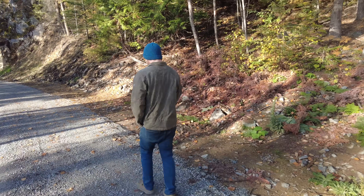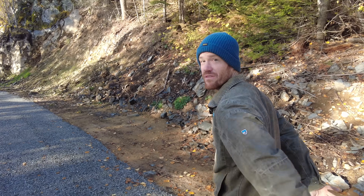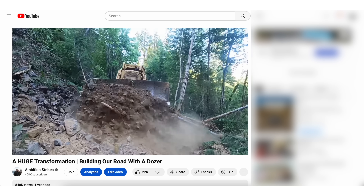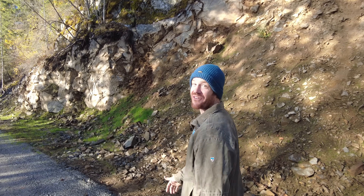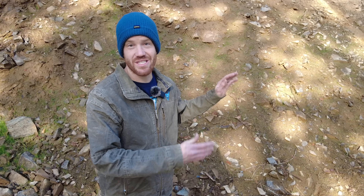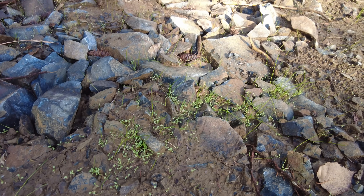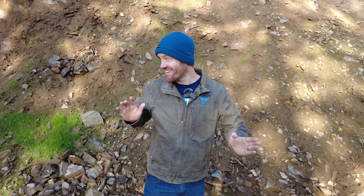But spraying the seeds was only step one, so let's go check out the progress. For those of you new to this channel, Courtney and I spent the last two summers building an entire new road to our property. I cut this all in with the dozer — it's steep here, which meant steep uphill cut banks, and those are the parts we were worried about having erosion on this winter. Wow, that is a lot of grass. When we seeded all this, we were seeing average temperatures of 62 degrees. We got about a half inch of rain two weeks ago, then another quarter inch last week — about three-quarters inch total since we seeded. We've got grasses that are an inch to two inches tall.